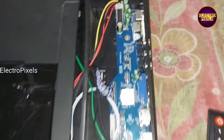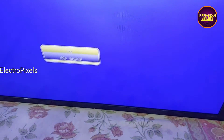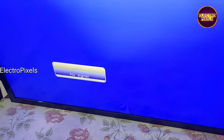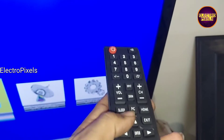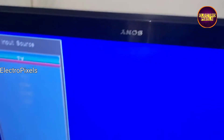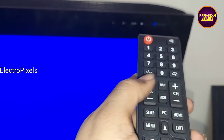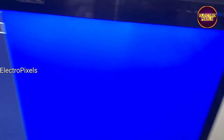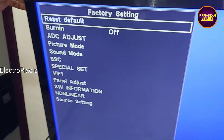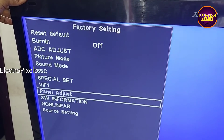These are the speaker connection, LVDS cable, sensor wires — everything is connected. Now the picture is upside down. The service mode code for this particular board is: press Input 2580 on the remote. In some models it will be Menu 1147. Here in this board it is Input 2580 for entering service mode. In service mode, first we need to adjust the LVDS mapping.